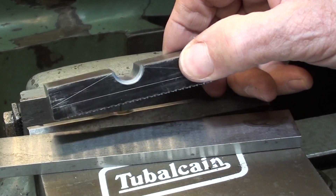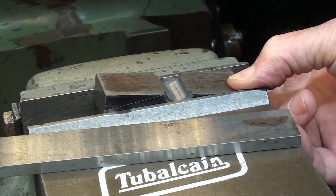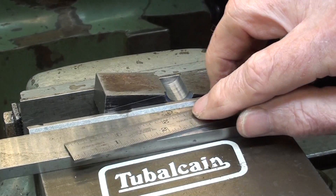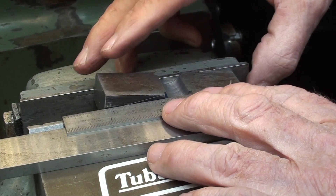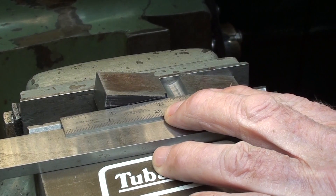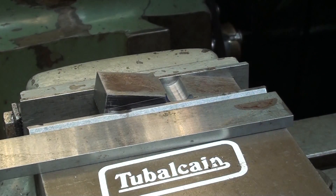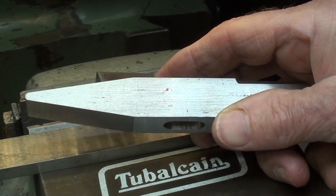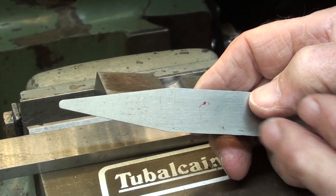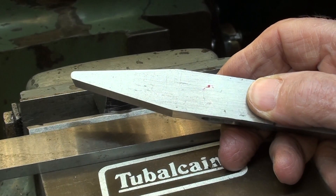If you decide to lay it out as I just showed you, you're ready to mill. Take it, put it into the vise jaws like this, then I like to take a parallel as a spacer and then a ruler blade, and adjust the work so it's right on the mark — you can use a hammer for that — until the layout line is perfectly parallel with the blade, and then you're ready to mill that side. If you watch the video where I made the hammerhead, that's essentially how I laid it out in the shaper — a very easy way for students to do it accurately.